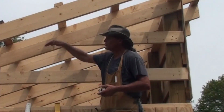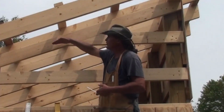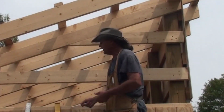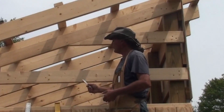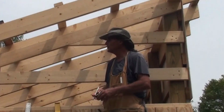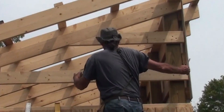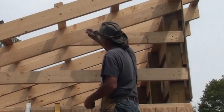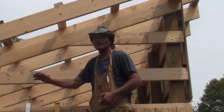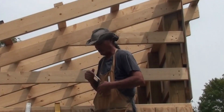But now it's trying to make sure that we get our angle correct when we're putting our siding up. Whatever height you want to leave it at, that's fine. You just know that whatever the height is here, for 4 feet, we have to go up 16 3/4 inches. So that's pretty simple. I just have to add 16 3/4 or subtract 16 3/4. So when I put this first sheet up here, whatever the height is on this side of the sheet, I'm going to subtract 16 3/4 from that side of the sheet on the other end. Hopefully this will make sense as we go along.